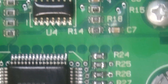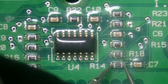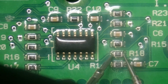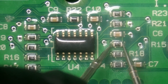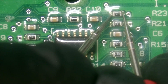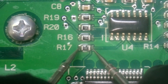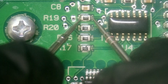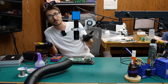Now we're going to make our way over here to ICU4. When these resistors fail it can cause this IC to malfunction — it's in charge of the stepper motors. R14 471 is showing open, in the mega ohms. R18 is supposed to be 10 kilohms — that is exactly what it's showing. R15 is reading 0.46 kilohms — within tolerance. R21 10 kilohm is open and will need replacing. R23 is 0.467 — that one's good. The next one is open. Checking the ones supposed to be 10 kilohms: the first two are open, this one is okay at 9.99, and the last one is 9.99. So about half or more of these resistors have failed — of course we're going to replace all of them.